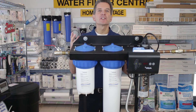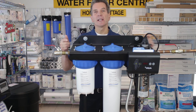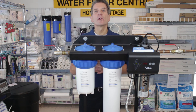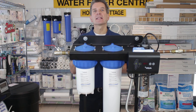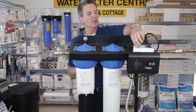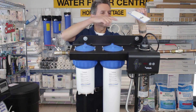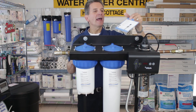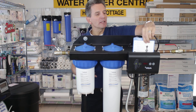Another great feature is that these units are made in Canada and are certified by the Water Quality Association. The input and output connections are all three-quarter inch and all metal. Power consumption is very low — only 50 watts — and the unit will operate on as little as 4 PSI and as high as 100 PSI. I also like this little card that comes with it, which reminds you how to change the UV lamp in the future and tells you what model UV lamp you need, making it really easy.